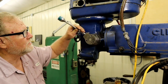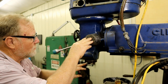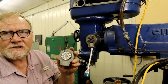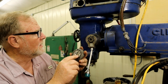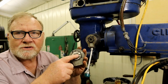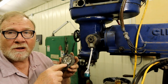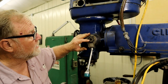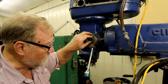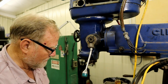What I thought was wrong wasn't the whole matter. This works independently until you pull it out and engage some dog gears, and then it'll make the shaft go up and down. I got it kind of taken apart, so the keys are out. What I had thought was wrong was the dogs on this dog gear and the dogs in here were worn out — and they were. So I TIG-welded all this up with some hard rod, then TIG-welded this one up, and ground it back down to tolerances. It fits real well now.